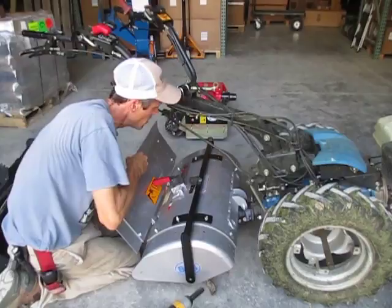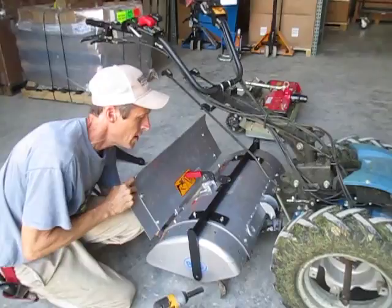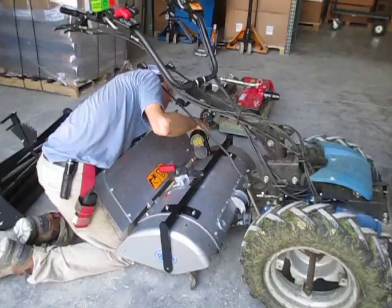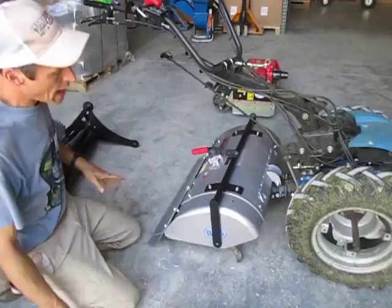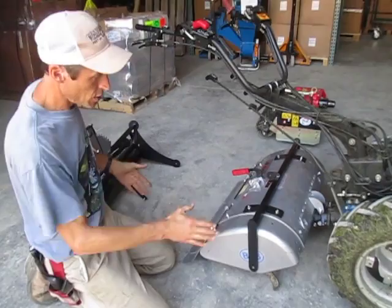Be careful when you reach under here because there are tiller tines under here — if you just stick your hand in, you can nick yourself on a tine. I'm going to tighten these using an electric impact wrench, but obviously standard wrenches work fine too. These are 13-millimeter fasteners throughout. Getting the wrench on blind is always fun. Now that the bracket is mounted, you could actually leave that mounted all the time. If you're going to take the roller on and off for different applications — say, if you want to till without the roller sticking out the back — you would just leave this bracket on and separate the roller assembly with these three fasteners.